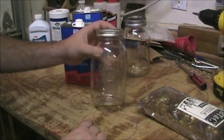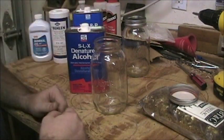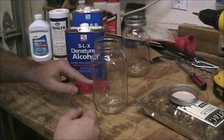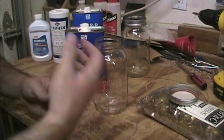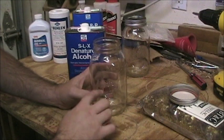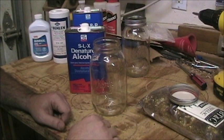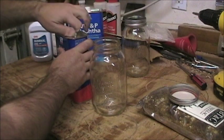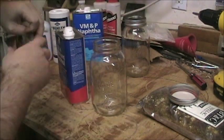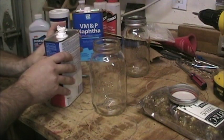The first thing I'm going to do is fill the jar with alcohol first. The reason is that if you fill the jar with shellac flakes first and then try to add alcohol up to the halfway mark, the flakes are going to displace some of that alcohol and your cut will end up stronger than intended. So I'm going to fill this about halfway with denatured alcohol first, then visually add about a quarter of my bag of shellac flakes. You can weigh them out for precise measurements, but eyeballing gets you very close.